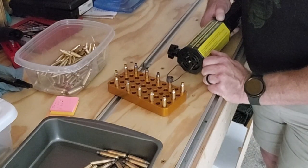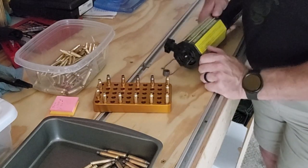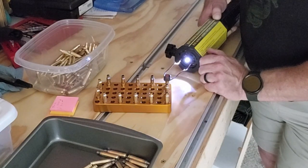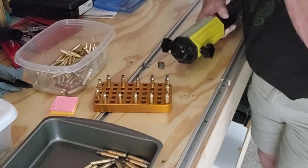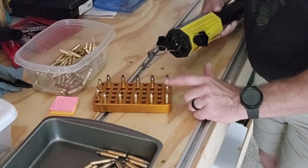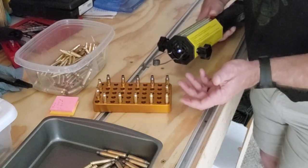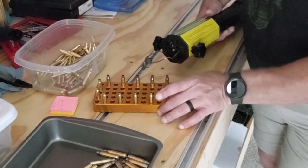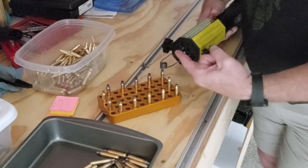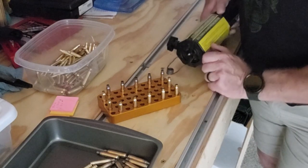That looked pretty decent. Maybe just a touch cool. That one was a bit warmer. Now, one of the things that affects this too is how far up and down the shoulder I go with where I place the coils. I try to get the top of the coils at about the top of the round. You're looking at it from the top, so you're not always 100% on it. And I look through it, and I've got just a slight margin around to see the shell.